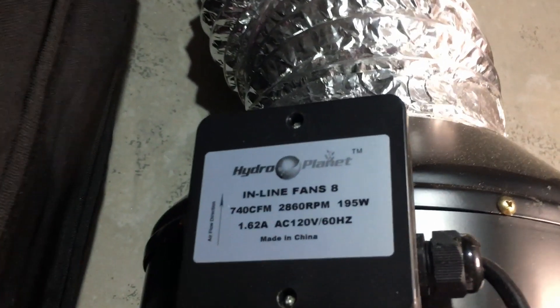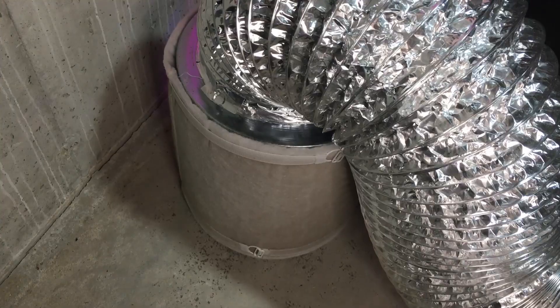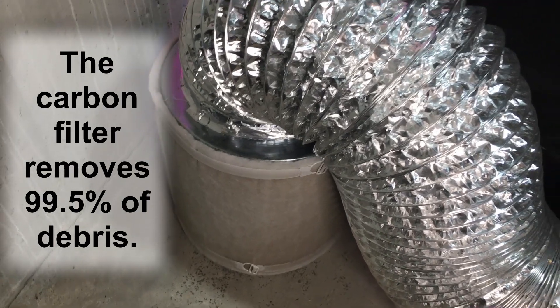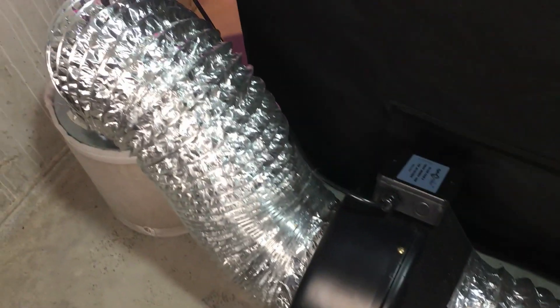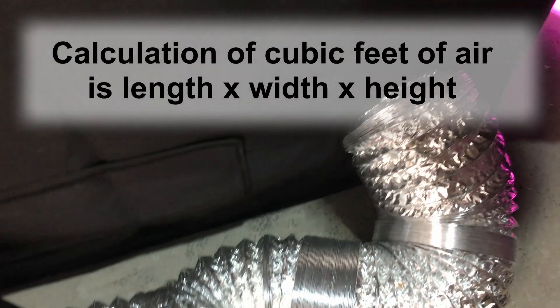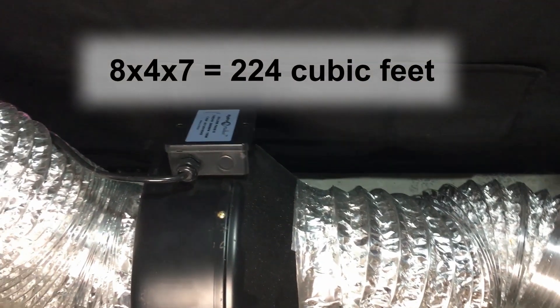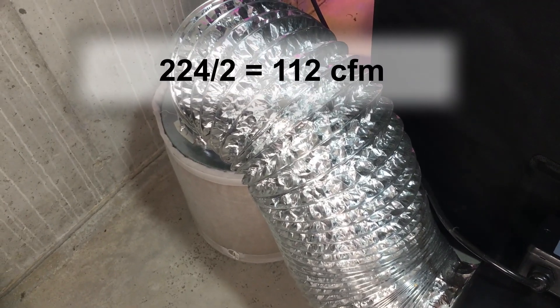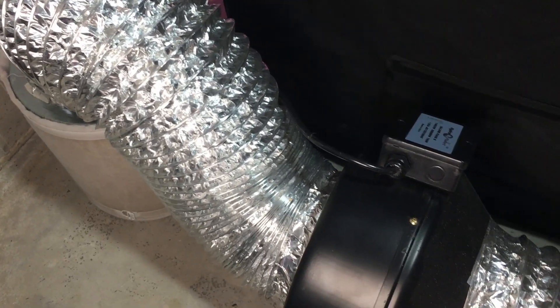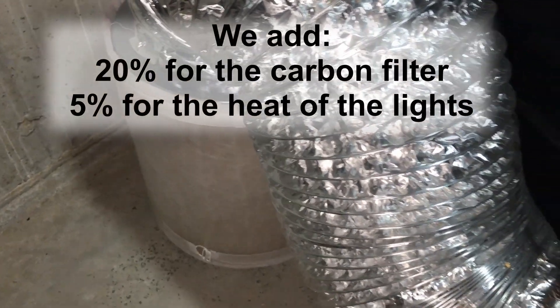The reason we run it on low is that we only need about 140 cubic feet per minute, so we have a fan that is more than capable of taking care of the air inside our grow tent. This is our carbon filter — it takes out about 99.5% of the debris that might go into the grow tent. It also factors into how we calculate how many cubic feet per minute we need. The calculation is pretty simple: we have eight feet by four feet by about seven feet tall, which brings us to 224 cubic feet. We want to replace the air every two to three minutes, so we divide 224 by two to get 112 cubic feet per minute. Then because of the carbon filter, we add about 20% to that overall — so we only need about 140 cubic feet per minute. This fan is going to more than do the job.